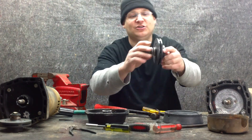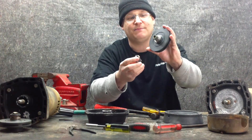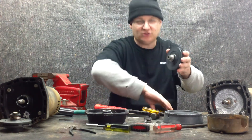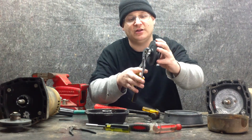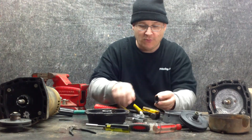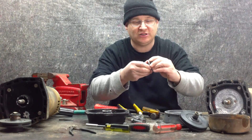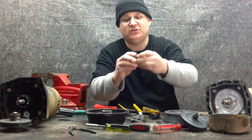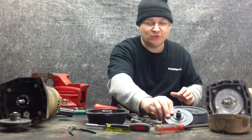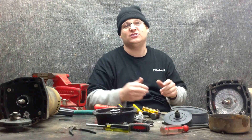The second part of the seal is mounted to your impeller. Sometimes you can get lucky and just grab it with your hand and it will slide right off. You'll be left with that piece of metal on there. When that little piece of metal is stuck, you can take a pair of channel locks and just grab it off like that — and then the second piece comes out. That's the whole part; you don't need the old seal pieces anymore. So these are the two pieces of your seal — one came out of the housing and one came out of the impeller. We're going to move the camera up close to show you how to remove both pieces so you can see it up close.